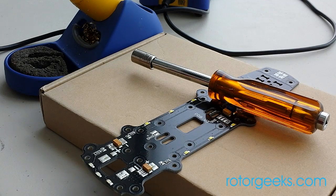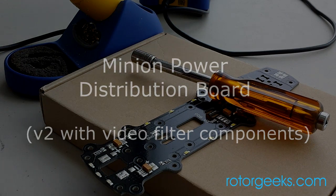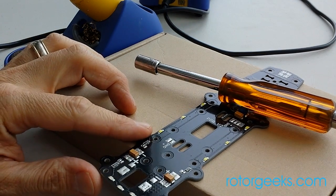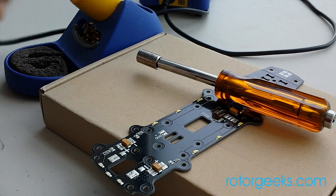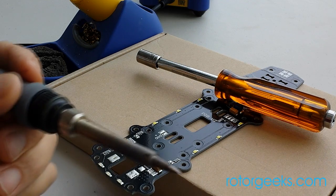I had a few questions about how to best solder up these distribution boards. The challenge is that if you try to go without enough solder or enough heat, the solder tends to bead off of them. So the easiest thing to do is just to prep the board first, maybe even before it's sitting on top of the carbon fiber frame. Take your iron — I've got mine turned up to about 670 degrees.